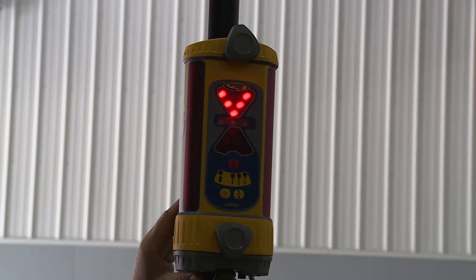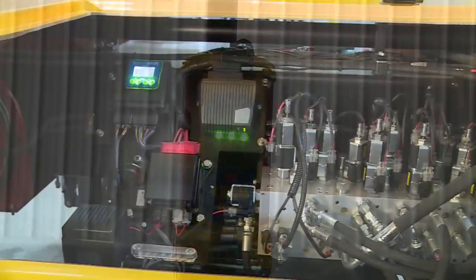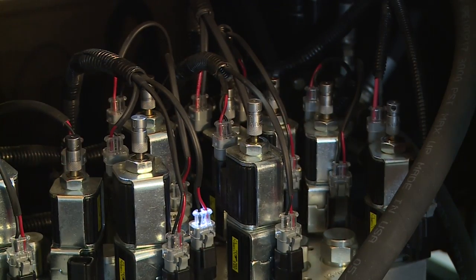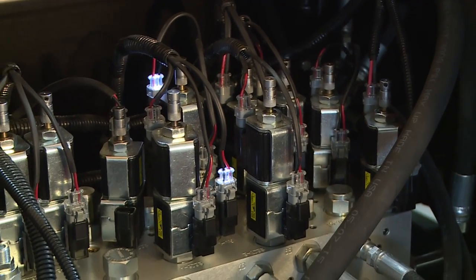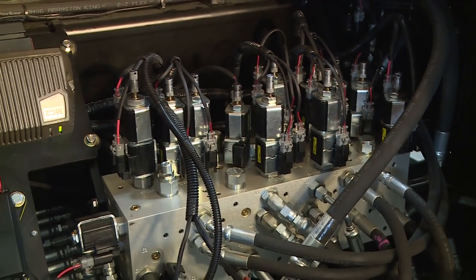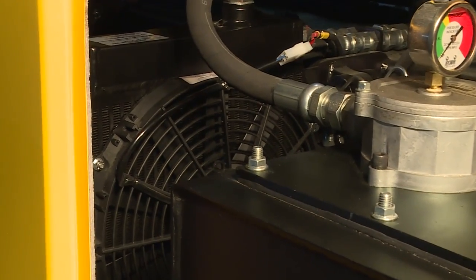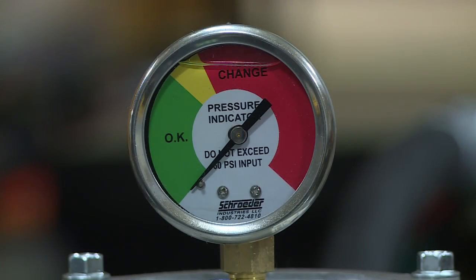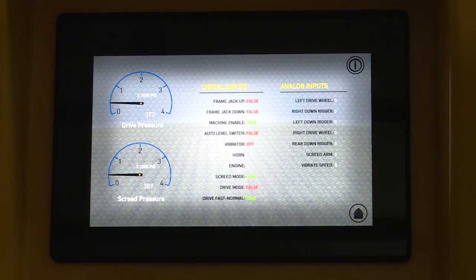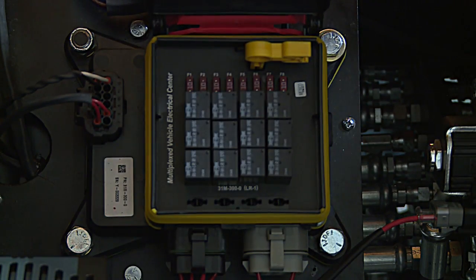Every Screed Saver ships with two Trimble LR-30 laser receivers with built-in 360-degree range of sight. We incorporate a state-of-the-art hydraulic distribution manifold with machine functions controlled by Parker proportional valves that light up when activated. Exclusive to the Boss screeds are dual auto-leveling valves that offer backup redundancy in the unlikely event of a valve failure. Reliable operation is ensured by a fan-cooled hydraulic fluid system that incorporates multiple filters to maintain purity of the fluid. Continuous diagnostic feedback is shared with our Parker display, and all electronic functions are protected by a readily accessible Cooper-Bussmann fuse and relay box.